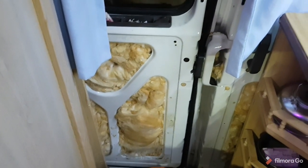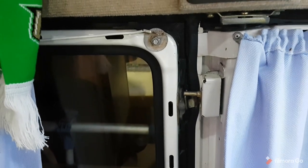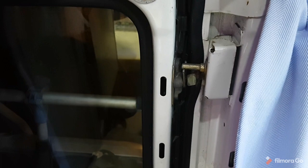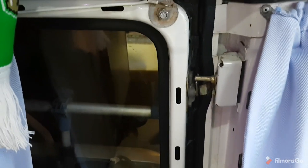Do I be pedantic? I've done that bit - took a good long time doing that one and the other door. But do I be pedantic and stuff rockwool down there - or whatever you call it, the stuff I'm using. I'm thinking you could use that spray foam gun stuff. But if I packed it down - because that goes all the way around the window and under - there'll be double glazing going on after that. Put the rockwool in there, stuff it down good like I've done down on the panel, then come up after with the spray insulation stuff. That's going to be the rail actually that I'm going to fit the double glaze into. It still works in me head anyway.